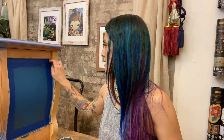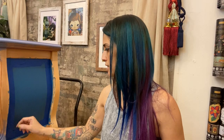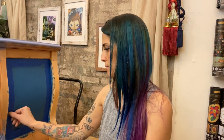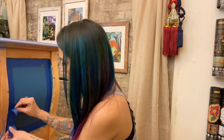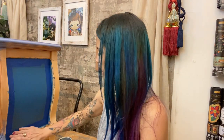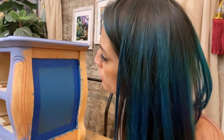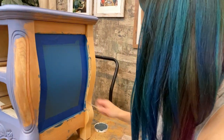Our inset area is all dry and I've gone ahead and taped it up. If you've prepped properly — cleaned well, sanded, and primed if necessary — then your tape should not pull up your paint. I get asked that a lot, and the answer is: if you've prepped well, it will not pull up your paint. We're gonna start painting the outside. I've already got a first coat here on this side, so we'll go ahead and do the first coat on the other side.